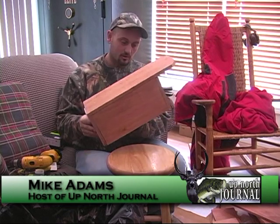We've got a pile of wood here. We're going to show you how to put one of these together. We've got enough material here today to build 3 of these boxes. And what you're going to want to get is a 6-inch wide, 6-foot long, by 1/2 inch thick dog-eared fence slat. It's just like a replacement board for dog-eared fencing, and it's made out of cedar.